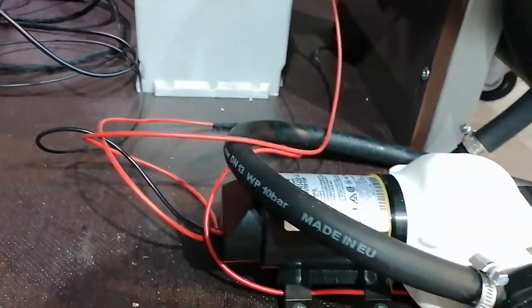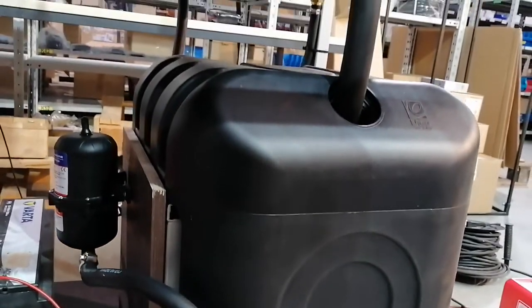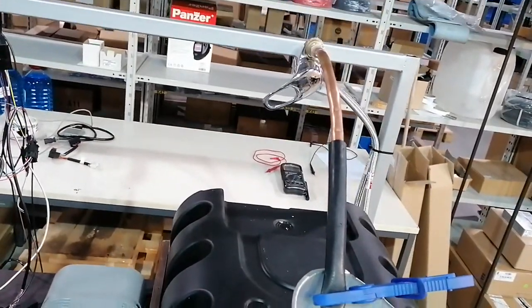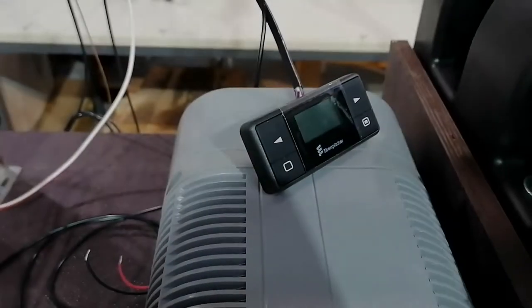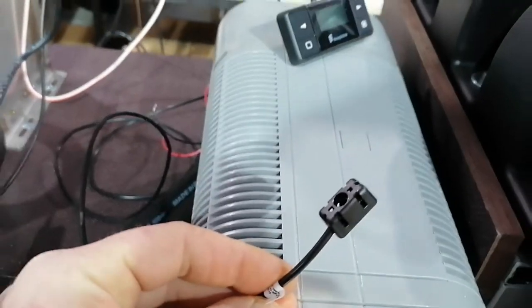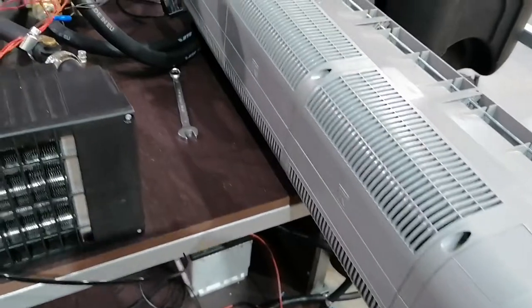There is also a little expansion tank and two big freshwater containers. During our previous test we found that the system is capable of maintaining 45 degrees centigrade for the warm water for a period of about 14 minutes, which translates to about 35 liters of water. I think for a camper this is pretty good, especially when you're off grid and don't have a constant supply of water. This is the controller we'll be using — it's an Easy Start Timer with a temperature sensor connected to it, so we can easily control the fans of the heat exchangers on and off depending on the temperature setting.